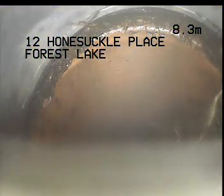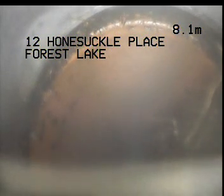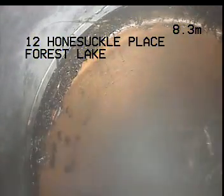Okay, so I've just worked that through with the jet, and it looks like we're at that council sewer connection. At that sewer connection, we have root intrusion. There are roots that are actually coming in. At 8.2 metres, I would say we're outside of our boundary. I don't think we're in our boundary area. I'll just see if I can locate, but I suspect that, as I say, it's not in our jurisdiction. I'll go and have a check now.